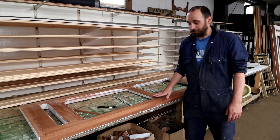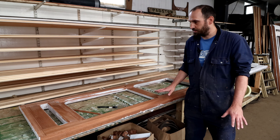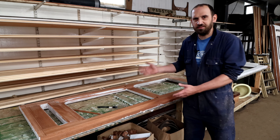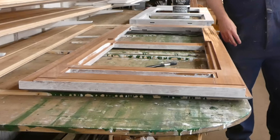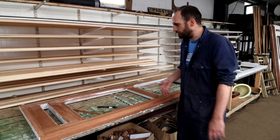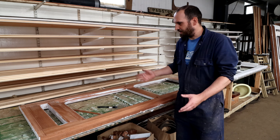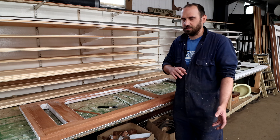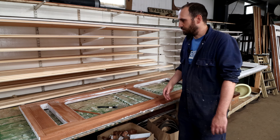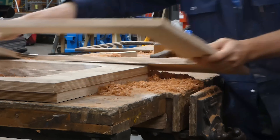Here's one of the new doors. It's made of solid sapele, a nice hardwood that we use for most of our timber work here. It's just started to be painted so I've turned it over so we can see the nice bare timber. As you can see it's all quite funky shapes in there, although it's a theoretically simple door. I've used an awful lot of router jigs that I've made myself because we've reverse engineered all the doors from the original ones. We haven't got any drawings so we've been having to make them up as we go along using the old ones as patterns.